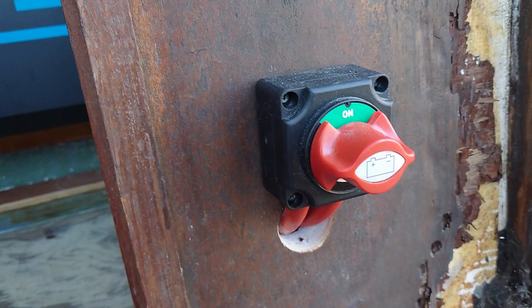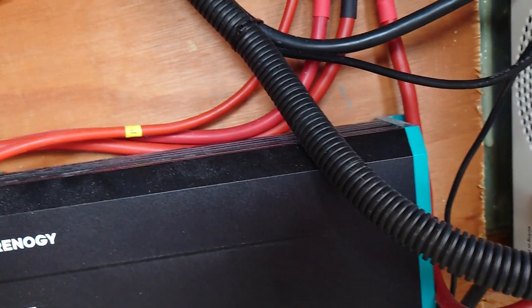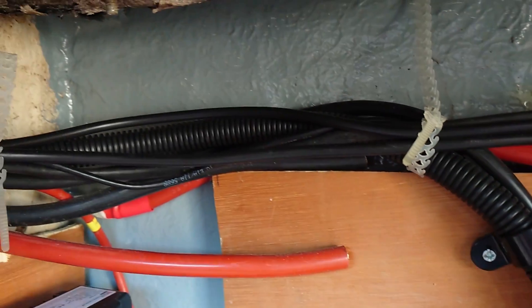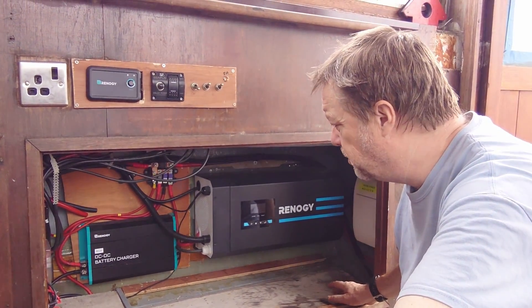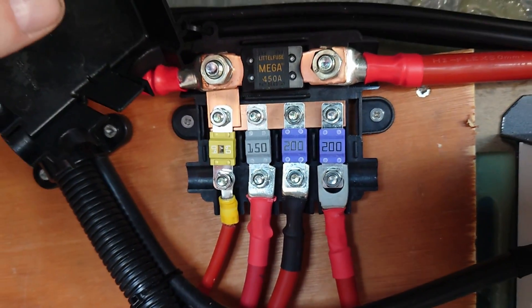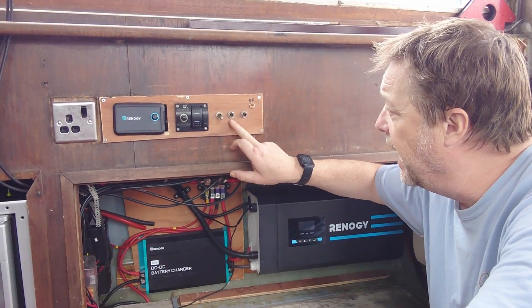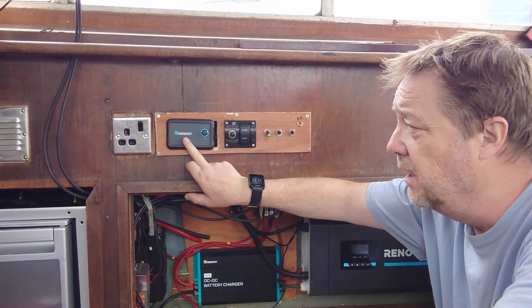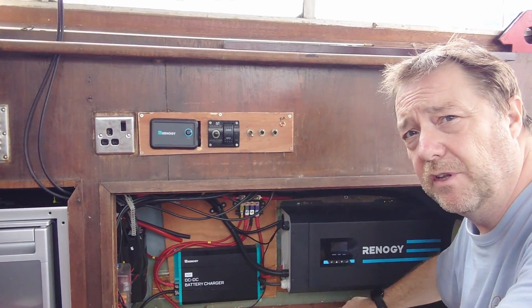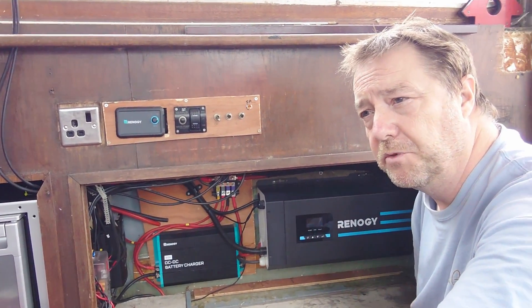There then followed several days of cutting, stripping, and crimping — making up all the cables and wiring everything up. After a while we started to get to the finishing stage, with the main isolator installed, the mains cables in conduit to isolate them from the 12V DC, and everything tie-wrapped and tidied up. So this head end cupboard is almost completed. We've got the fuse boards in, we've got the wiring in, and we've got one of the sub-boards including the WiFi, the bilge pump, the secondary bilge pump, the water pump, the controller for the inverter, and the mains supply from either the inverter or from shore power.